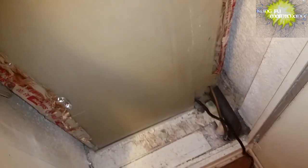Definitely have something wrong here — the condensate pump is just running nonstop. Go ahead and unplug it. Okay, unplugged it — it's definitely that. As soon as I plug it in, it just runs nonstop. So it sounds like the float is probably stuck on the condensate pump. Take a peek inside.